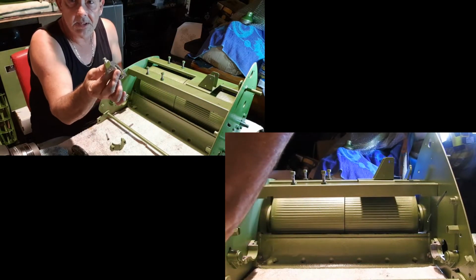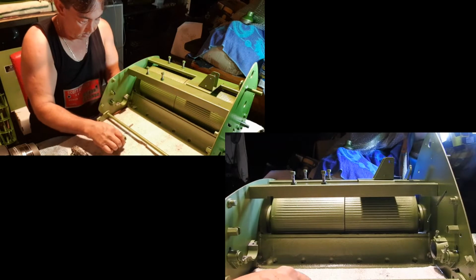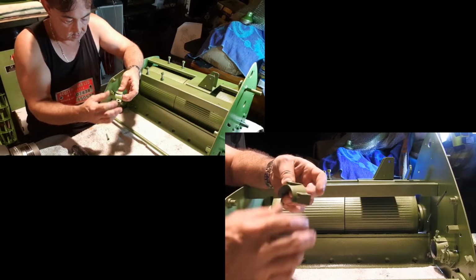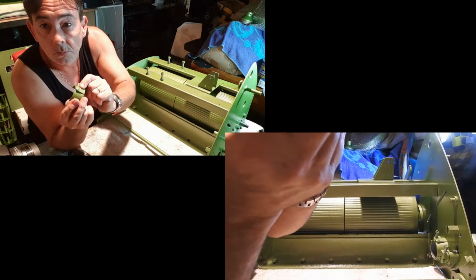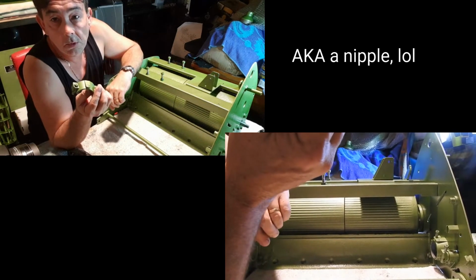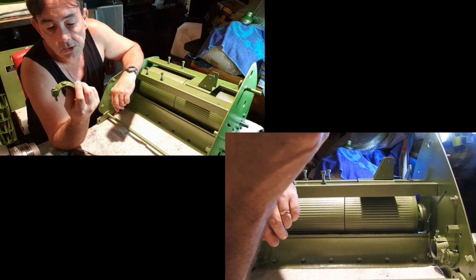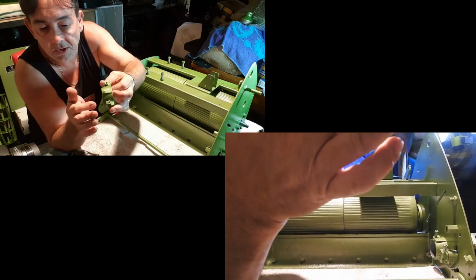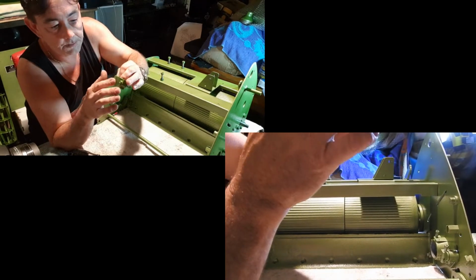Okay, now these parts here, you can just sit them there temporarily so you don't lose your bolts or whatever else. They're not going to be put together until we've actually got our reel in place. You might notice on some of them you've got a little dimple at the top here. That dimple was originally for non-sealed bearings so that you could lubricate those. We now use sealed bearings, so that's redundant. If yours has got a little cap or whatever in it, great. If not, according to the Bible, you can just put a little bit of silicone in there and block that hole up.